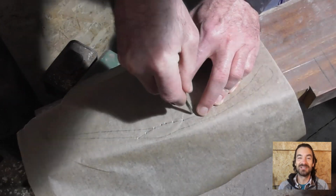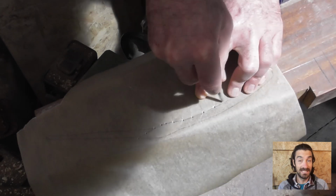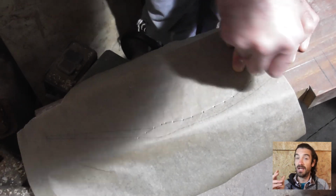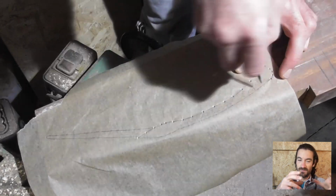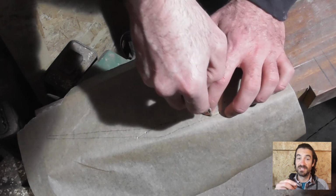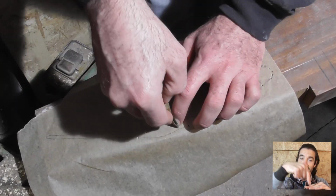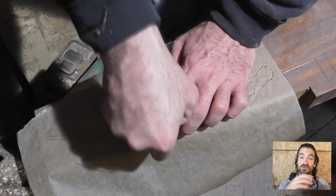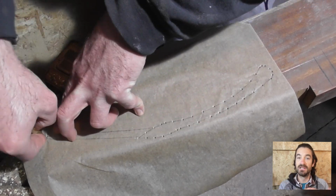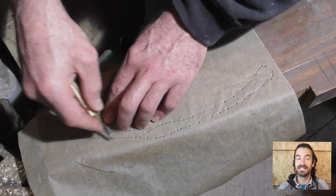So this is Bellatrix Lestrange's wand. It's quite different to most normal wands. Whereas I'd normally be turning the initial shape on a wood turning lathe, here I've got a big chunk of teak and I've got the actual scale drawing onto a piece of transfer paper. I'm using a centre punch, punching holes all the way around the drawing, and that transfers the shape onto the piece of wood, and then I can join up the lines to make the correct scale and shape.